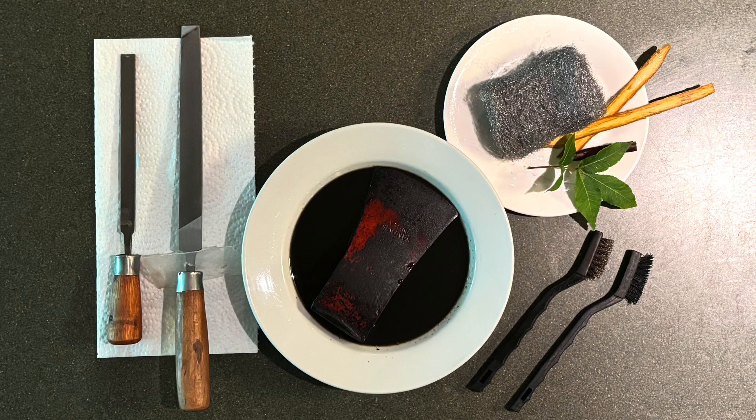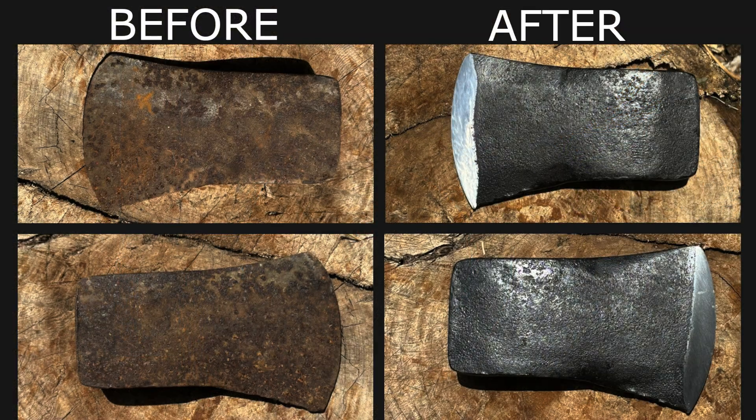This video is not actually going to be a soup recipe. It's about a technique I use when refurbishing axes and other vintage tools to convert active red rust into stable black ferric tannate. This chemical process is the same one that occurs with some commercial rust converters, and museums use it to preserve iron and steel artifacts. Trappers also use it to refurbish their traps — a process called trap dyeing — and I'm doing a home version of that because it's cheap, easy, and I like the results better than commercial rust converters.